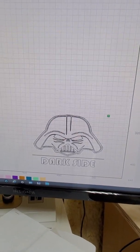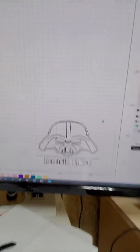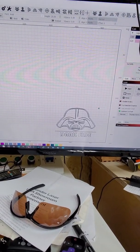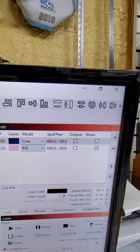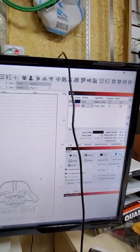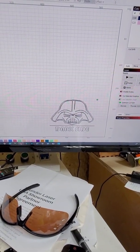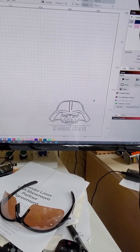What I've done is I've loaded this graphic in. It has a lot of curves and sharp angles for the laser to go around. This is going to be a cut — I'm not going to try to cut through, I'm just trying to show you the precision with the speed and the quality. They're all rated at 400 millimeters a second and around 40 to 50% power depending on the size of the machine. The speeds will still be the same so you'll be able to see a direct comparison. I've already sent them all to the machine. We'll go take a look.